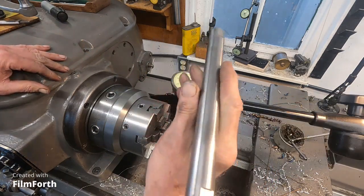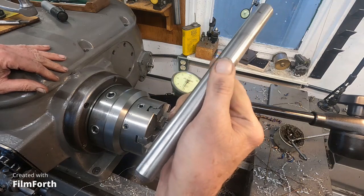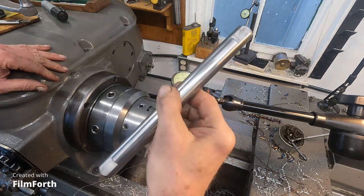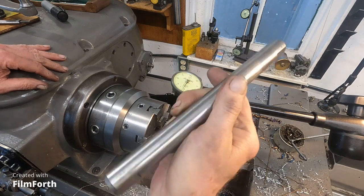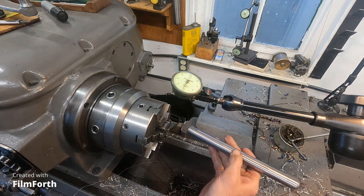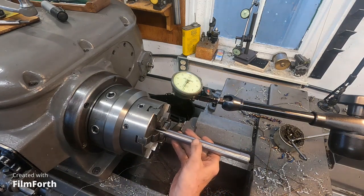What I have in my hand here is a transmission countershaft out of — I don't know what — but often items like this, transmission countershafts, are gauge accurate because they've got to be accurate. So let's take this transmission countershaft and I'll slide it into that chuck.